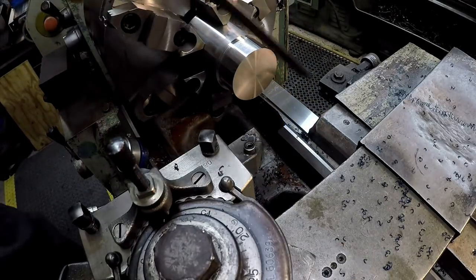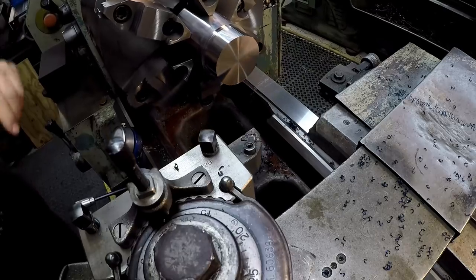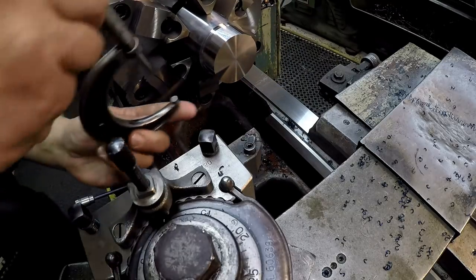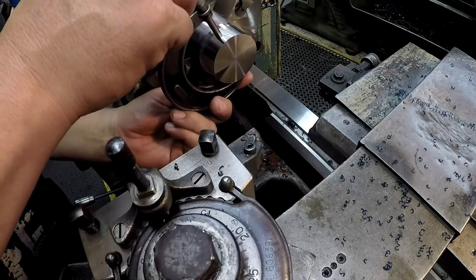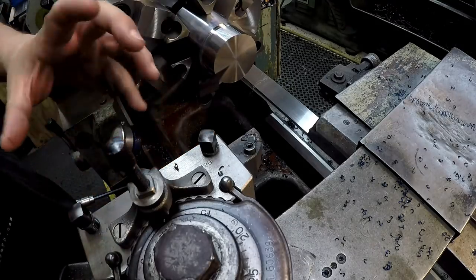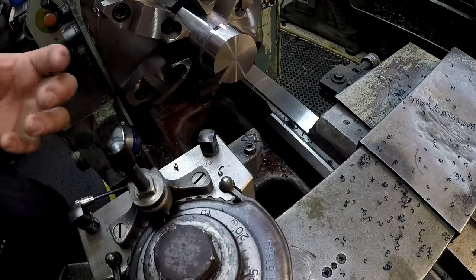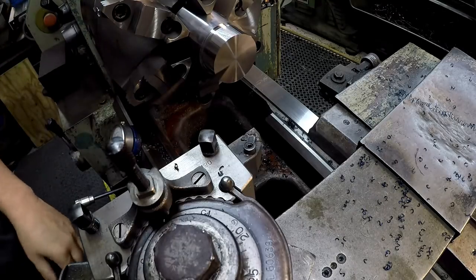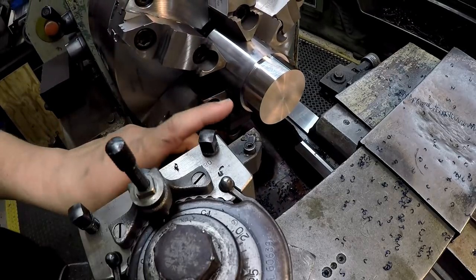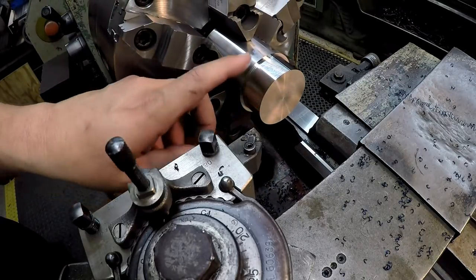So what I may be using this for after we've machined the nut is a fixture to hold it and face one side off true with the threads, so that whenever the nut is screwed down onto the bar, whenever it tightens up against the face of the clapper, it's nice and flat. All right, we're right there where we need to be. So what we'll do is cut us an undercut through a thread relief and of course chamfer our corners there.